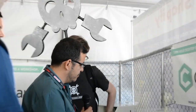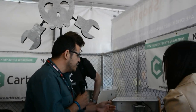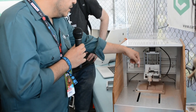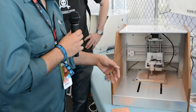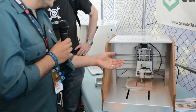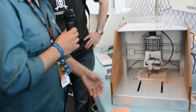And this is good for through-hole drilling as well? Yeah, we've got a way to do tool changing. It's not automatic, but it'll tell you to change the tool. You change your tool and we have a tool length setter, so it'll come here, re-zero the Z, come back and do your job — super easy, no hassle. So you can do different drill sizes. After you've drilled the through-hole, you change the tool for an engraving bit, and then you can do the milling.